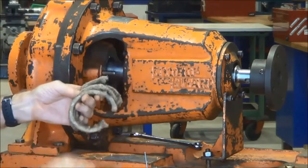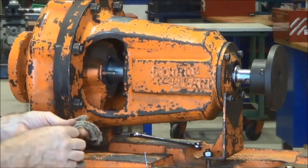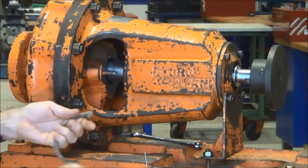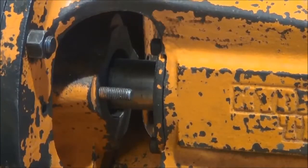It's important to count the number of strands we've got. In this case, we've got 7 out of that pump. That means at least seven new pieces, and one more probably, just to keep the gland back from the stuffing box and allow some periodic adjustment on it.